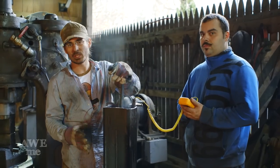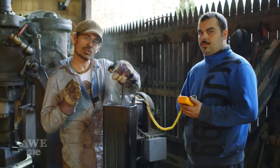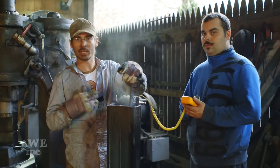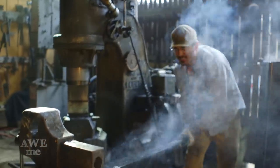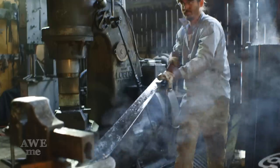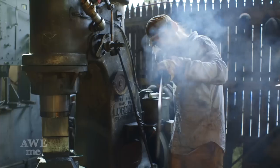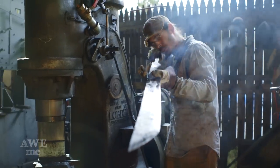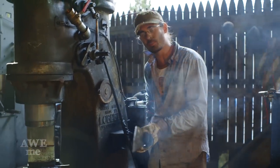Master Yi's sword has been in the tank for about an hour already. In the tempering, this is actually the last opportunity to straighten out any warps produced in the quench. So, I'm going to take it out and go to the vise to quickly yank some of them straight. So, Master Yi's sword is basically straight. Any other warping along the edge will be fixed in the grind when it's made sharp.